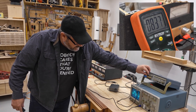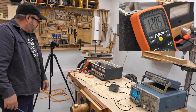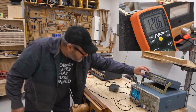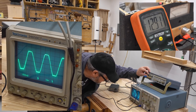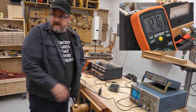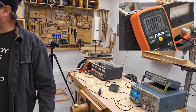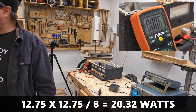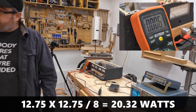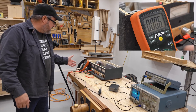I'll jack that up and right here it's clipping at 12.75 volts at the peak — into 8 ohms, by the way. So I'll take the calculator: 12.75 times 12.75 divided by 8 equals 20 watts. That's 20 watts before clipping from this amplifier into 8 ohms. That's not bad actually — that's pretty good.